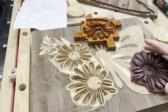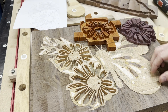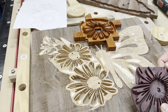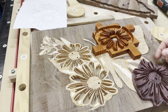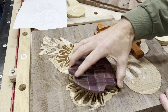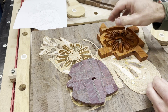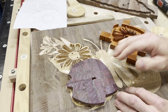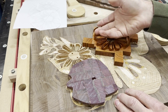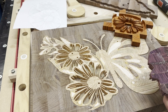There are steps that can lead to efficiencies in both creating the layers and different files, and in cutting things in the plug, and getting them consolidated to use less material. With these two different materials, in order to glue them in at the same time, I stuck them down and surfaced them at the same time so that they're the exact same thickness and I can press them in simultaneously. If I hadn't surfaced them to the same thickness, I'd have to glue one in, clamp it, wait till the next day, then surface that off and glue the other in — it adds an extra day.